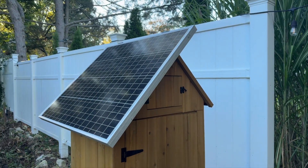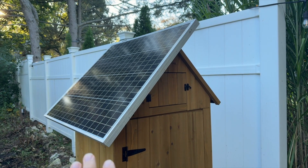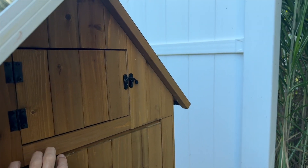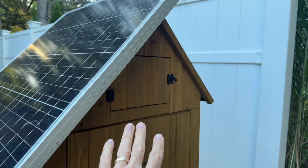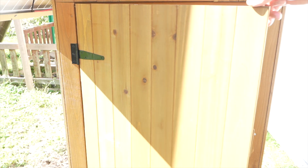In this configuration, it's nice that when the sun goes down and the low-battery value you set in the app is reached, the C300 will shut itself down. But because it's connected to the solar panel, once sunlight hits the panel in the morning, it'll wake the C300 back up and continue charging its internal batteries.